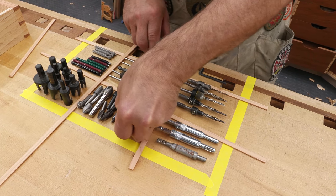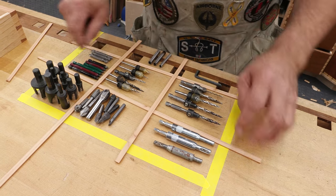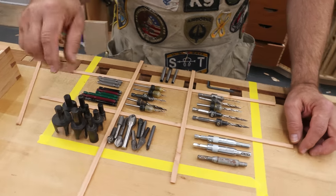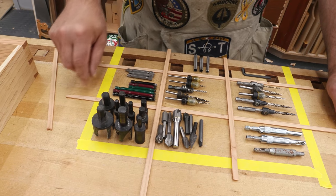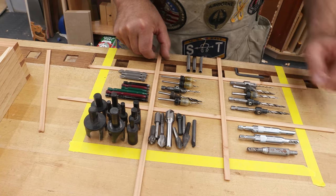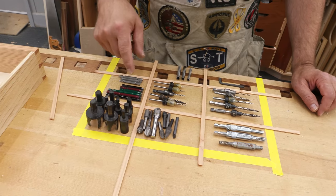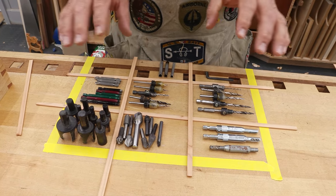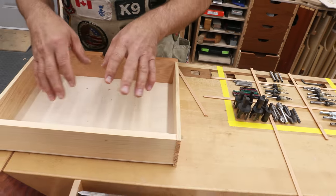So these will come up in here if I don't wreck the whole thing in the process. I'm going to take a little block of wood and drill holes, turn these upside down so they'll stand in there and then they don't tip over every time you open and close the drawer. So this is going to be pretty simple. We're going to have a total of four pieces, so four easy joints. It's going to be really important. We want those to fit in there perfectly, no slop.